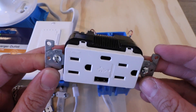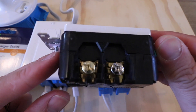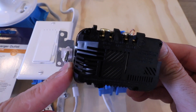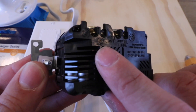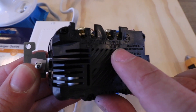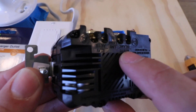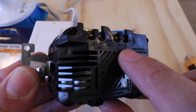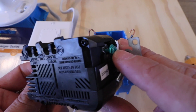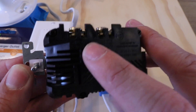This new outlet is a little different from the one we removed — there are only terminals on one side. Looking on the back, we can see which terminal is hot and which is neutral. The top terminal is hot and the bottom terminal is neutral (white wire). So the black wire goes on the top terminal and the white neutral wire on the bottom. We'll also connect the ground stud at the top. We just need to take our wire loops and wire them up to these two terminals.